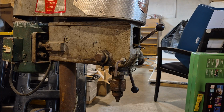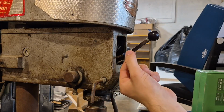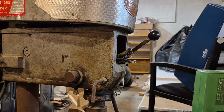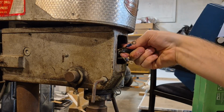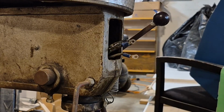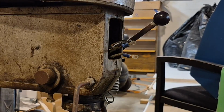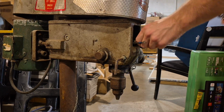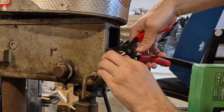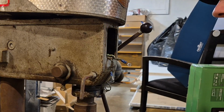Contactor screws need to go back in. If you notice, they just put 2 little crimp-on ends at the end and just ran them through the screws, which honestly is probably what I'm gonna do too. And then interestingly, they taped the ground and neutral together, which is something you're not supposed to do. So because of that, I'm gonna say that yes, somebody at some point replaced it and they didn't wire it properly. I'm gonna go ahead and chop it out of there and go from there. Yeah, this is just disintegrating as I'm speaking, but that's something they should have never done.